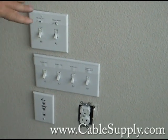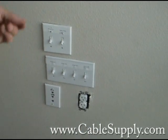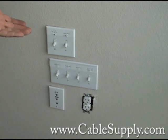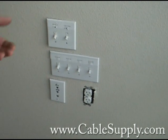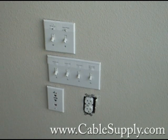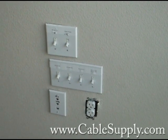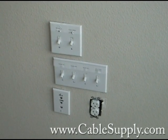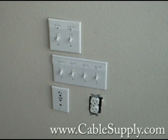What you need to do — you never do this — is put in the proper cable with the proper jacks, and then it needs to be tested with handheld cable testers or certification equipment. A professional cabler will always have handheld certification equipment that will test every parameter of a wire and a jack to make sure it will support the network speed that you've paid for. Very poorly designed system — I bet you thought that was cool, but it just didn't work very well.